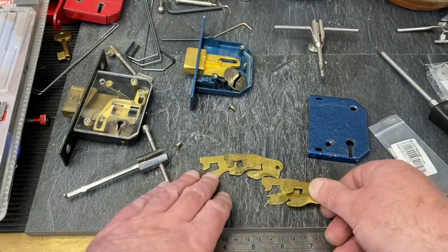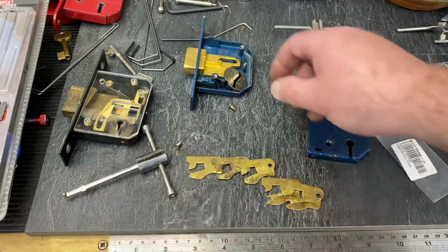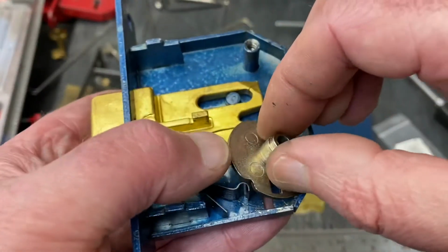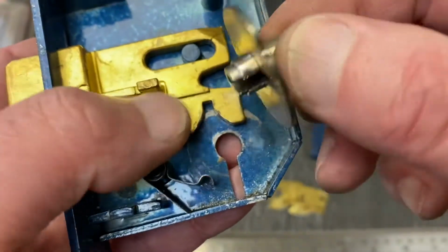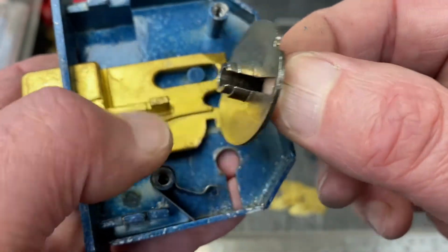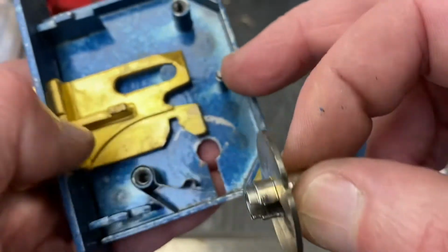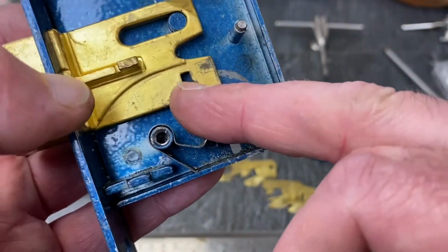So we've got 2 2s, a 1 and 2 4s. Opposite pitting. Now we look at the bolt. As you can see, that bolt will just spin round. There's nothing for that curtain to grab onto that bolt, into that gap. Your key's going to get into that gap, okay?